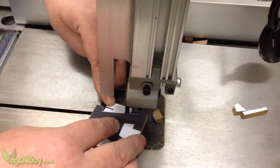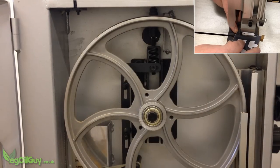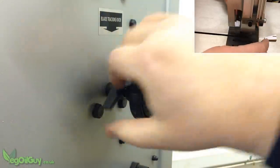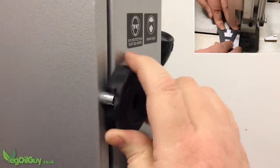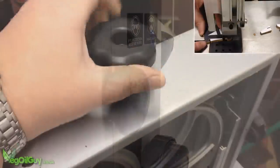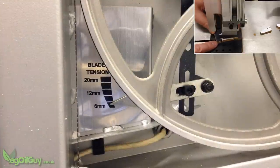When I changed the blade, I found the process pleasantly easy. There's a large tension release lever at the back of the machine to aid this. Tracking the blade is also simple thanks to this large knob, and it's great to see it has a locking mechanism to help keep things just right. Accessing the inner workings is easy thanks to these sturdy knobs, which neatly self-close as the door returns. Tension in the blade is child's play thanks to this top knob. The upper door has a handy window which displays a tension guide.